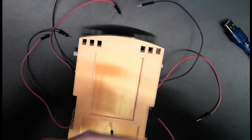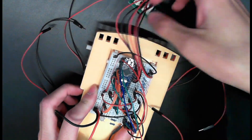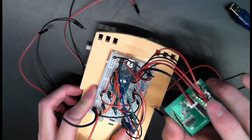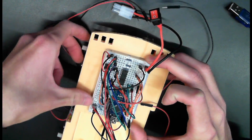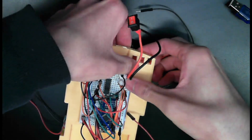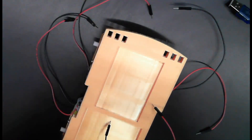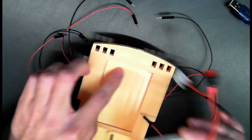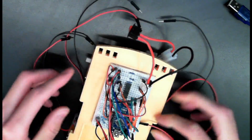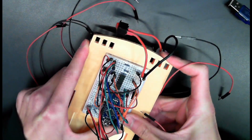For the breadboard orientation, I originally was going to have it this way so your USB port was easier to access, but the remote control receiver needs a place to stay, so we actually have to put it this way. These breadboards have an adhesive backing that you could use — you can remove that if you want. Once you're done with your schematic, you can just take it off and stick it to the square that is fit for the breadboard. You can also do a bit of a friction fit as well, just pressing it in.